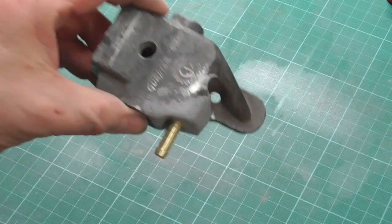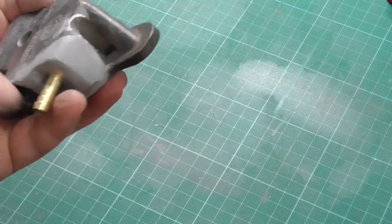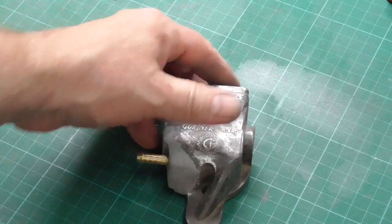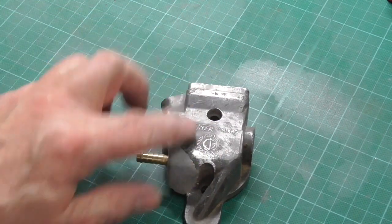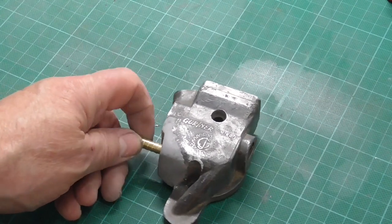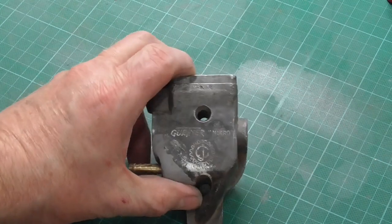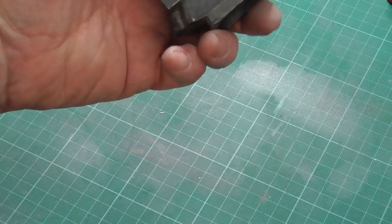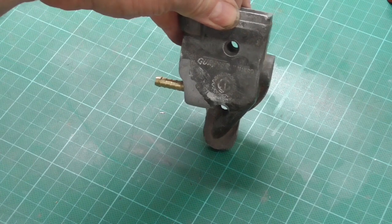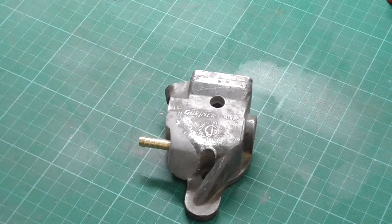After a little bit of filling with some Cargo QuickSteel and a little bit of filing and shaping — there we go, that'll do the job. I did try to build it up with DuraFix but it wouldn't take to it. I didn't want to go near it with a TIG welder because it's almost irreplaceable, so at worst it can have a little bit of paint to tidy it up.